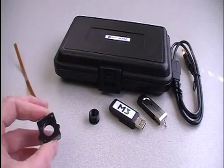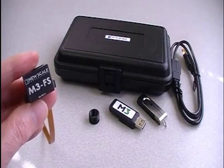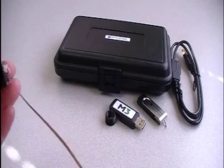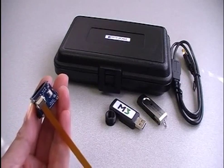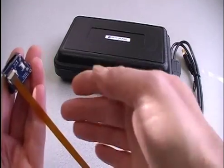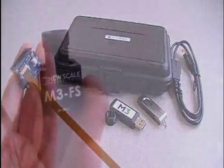This is the developer's kit for our new high-precision M3FS focus module for OEM system designers. It's a miniature focus system that you can use in your new handheld, portable, and mobile devices. It has all control electronics integrated into the module — there's no external control board. It runs on 3.3V input and simple high-level motion commands from your image processor over the standard serial interface.